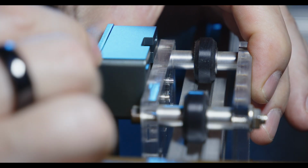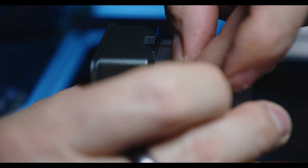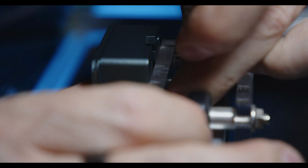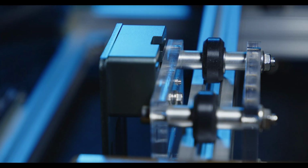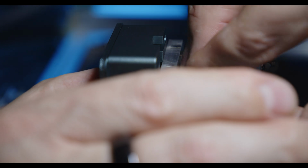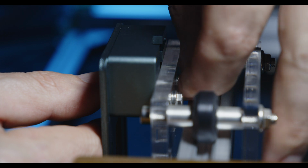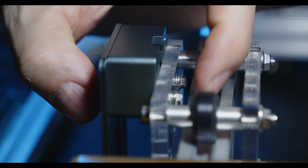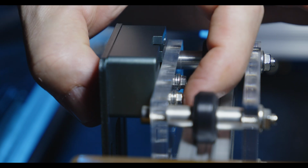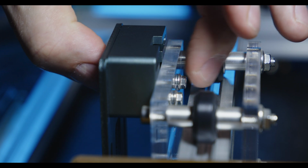The 2 supplied nuts do have washers, or a washer face. So we just pop that in there, mind my fingers. I'll just try and spin that on loosely. There we go. You can see there's just enough threads for the unit to grab and start fastening. It's certainly not ideal. The engagement's certainly not full depth. So for the sake of this video I'll continue, but it would be wise to probably get some 35mm long bolts and fully engage those retaining nuts there.